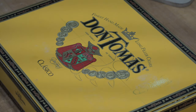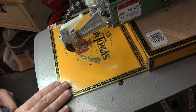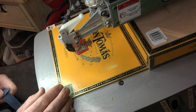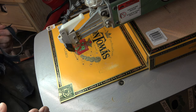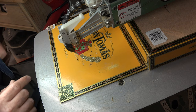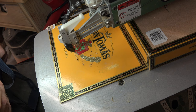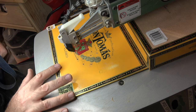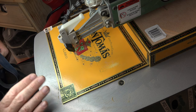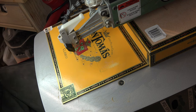The reason I chose a spiral blade for this is because I don't want to separate our lid from our cigar box. It's very difficult to spin this piece on a scroll saw using a conventional blade. With a spiral blade it cuts on all sides — all 360 degrees — so you can just move your piece on its X and Y axis, acting almost like a human CNC machine, and cut out your sound hole that way.